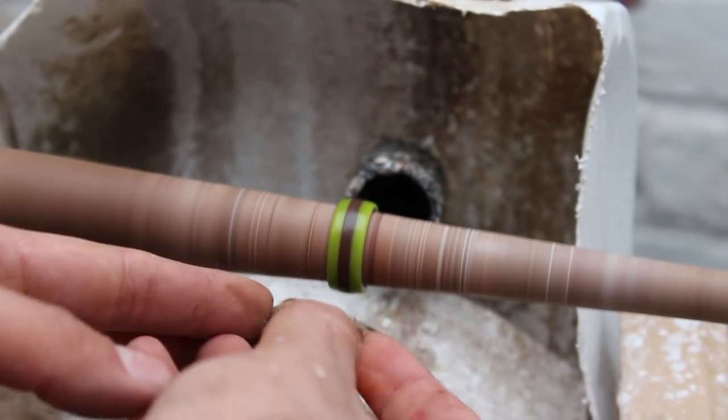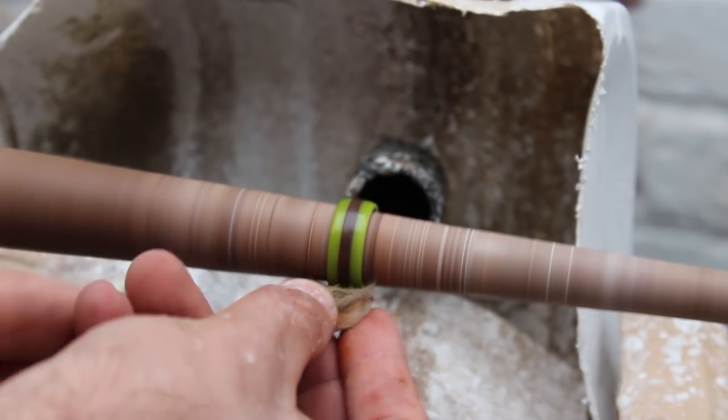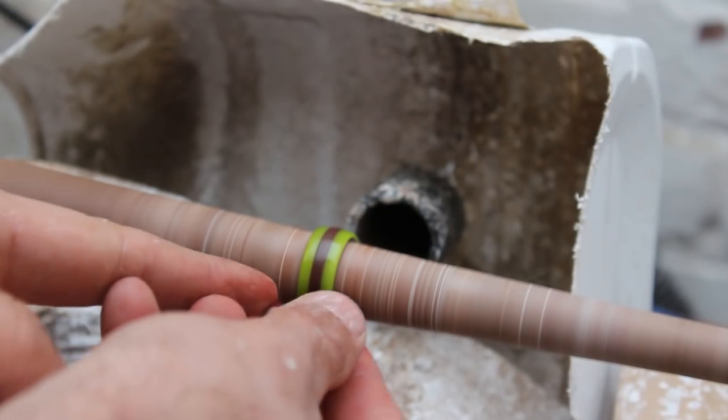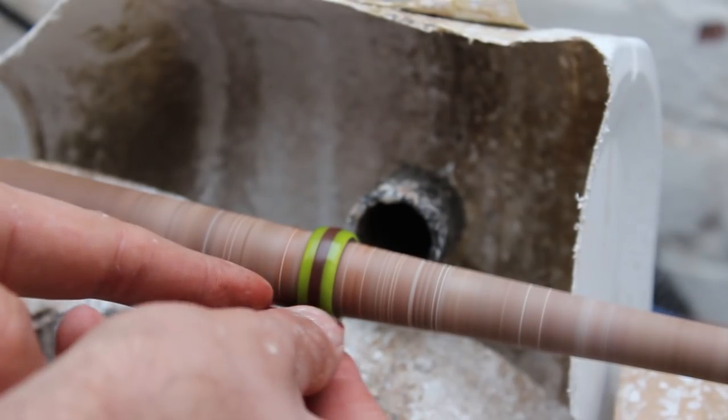To bring the surface to a gleaming finish, I turned up the speed on the lathe and used 2 polishing pads with Tripoli and Rouge polishing compounds. After the rouge, I could see my own reflection in the ring.